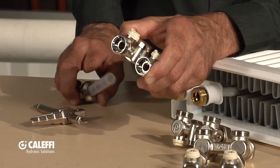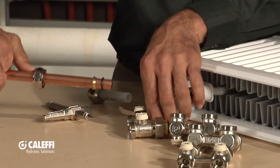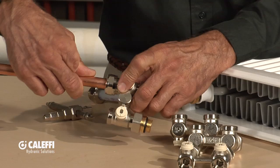If you don't want to use PEX, some guys prefer copper. We've got a compression adapter — all the pieces sit inside. You slide them over the copper, and it's got a double O-ring seal plus a ring that bites into the copper when you tighten it up. It's just a compression fitting to put the copper into the bottom of the valve.